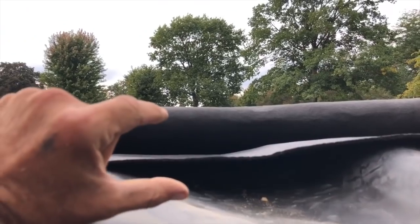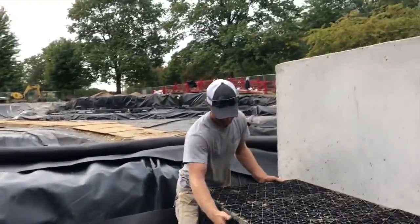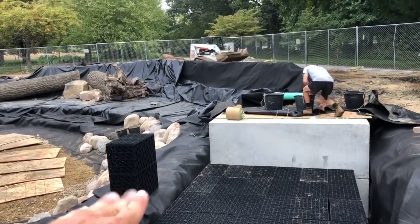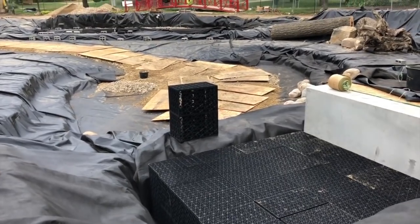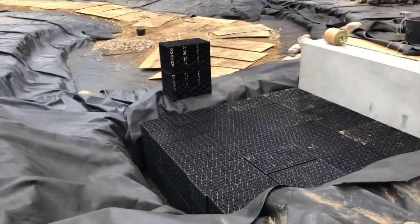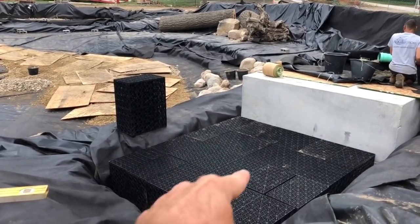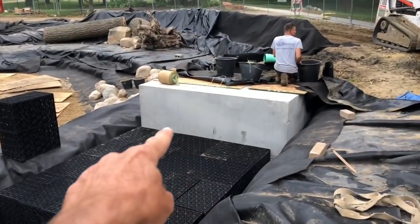On top of this we're not going to have gravel — we'll use flagstone, so it's going to be really nice and smooth, allowing for a very consistent flow of water. Our next steps here over at the intake bay: you can see our elevation is set about four to six inches above our aqua blocks. We over-excavated some of these areas to make installation easier and give us lots of room to work. We don't want to cover the top of these blocks with large boulders, so once we fill this joint with river stone, we'll get some big rocks over here that are not going to be sitting on top of the blocks. The aqua blocks could handle that weight, but on a large pond like this, this is our pre-filter — we don't want to block that space down to just a three-by-three-foot area, because they would be out here constantly maintaining it. We want to give them as much square footage as possible.